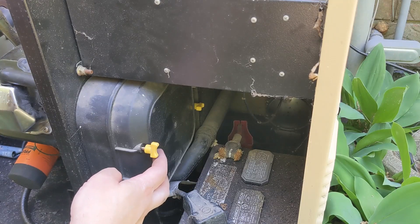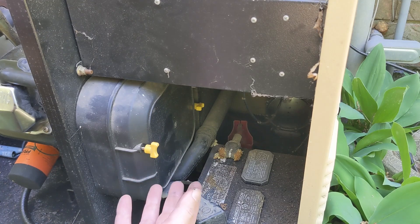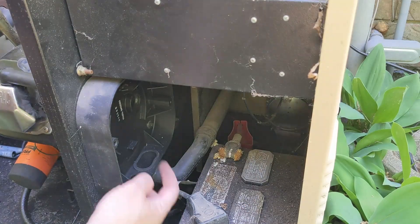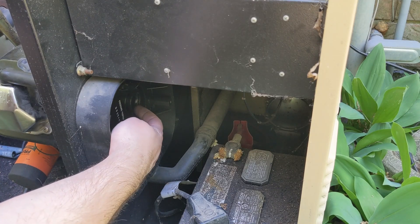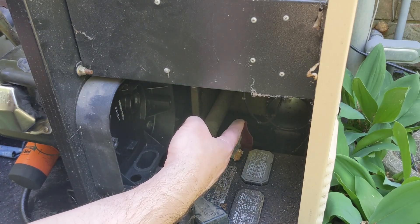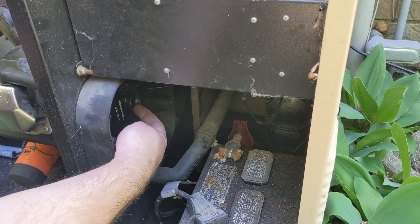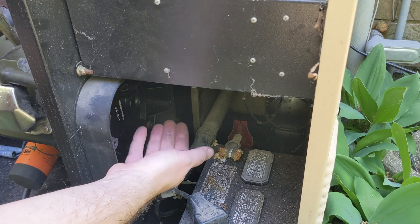I'm going to pull this air cleaner off and we can at least check to see if we're getting fuel. It's not quite as easy as with gas because this is natural gas, so it's obviously always gaseous — there's no liquid. But you can usually tell just by smell. Right here, I'll zoom in for you, but this is where the air goes in, and there's actually an orifice that comes from a gas valve. The gas valve, solenoid, and regulator are all back here, and it comes through a pipe that enters in the middle of this venturi. What I can do is put my finger over the top of this, and that will choke it.